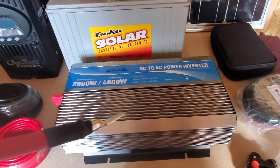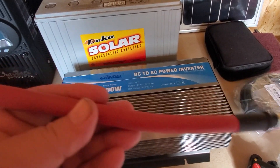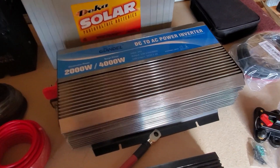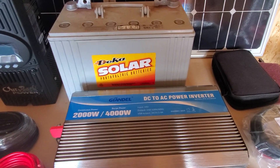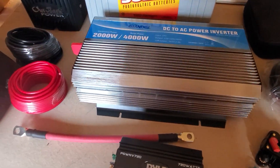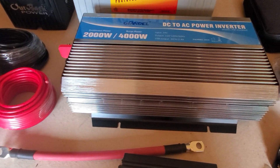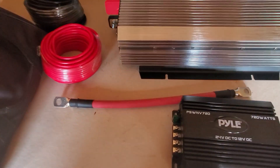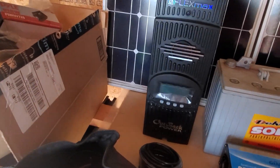Being at 24 volts I could really get away with 4 gauge, but I'm doing 1 gauge so I can upgrade things later if I want to. I've got 1 gauge cable with lugs I already made from another project. It will be used to wire the batteries in series and parallel, and to run from the battery bank to the inverter — more than what's called for, but you can't really have wire that's too big. You can have wire that's too small and start a fire, but not too big.